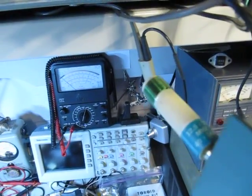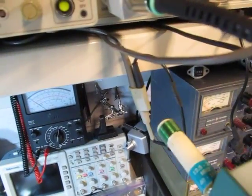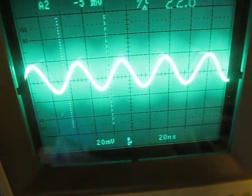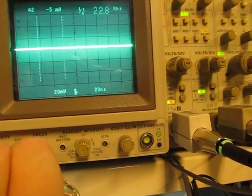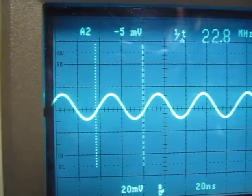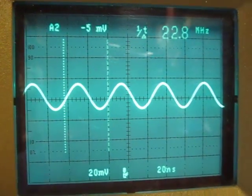In fact, we can actually see this thing oscillating. If I take this same coil and couple it down — you can see I've got my little scope probe here, just kind of looped together — if I stick that coil inside there, I can actually see on the scope there's my signal. And now we can actually see the sinusoidal oscillation of this thing as I stick it in the coil. The cursors marked out show that same 22.7 to 22.8 megahertz oscillation.